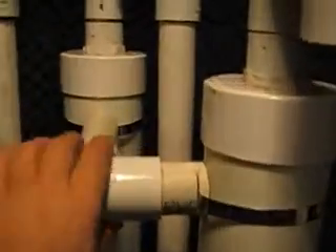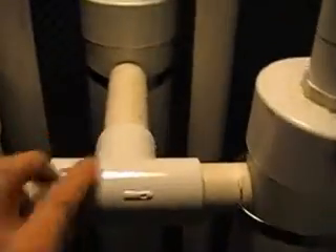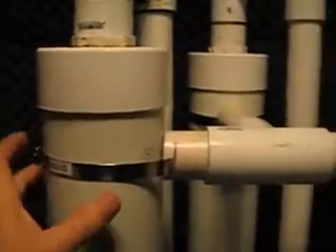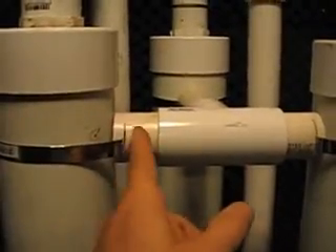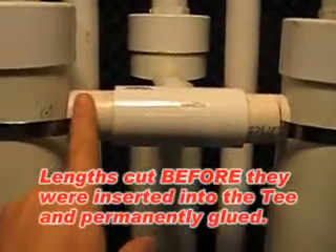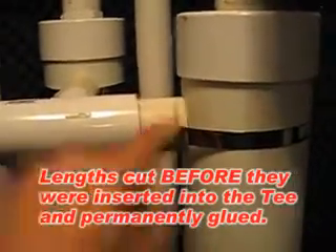What I did is I made some braces. I used one-and-a-quarter-inch T-connectors - you've got to make two of them, one here and one down at the bottom. I used four-and-a-half or five-inch pipe clamps to go around these, and I took a hacksaw and came back a quarter of an inch or so and sliced back on those so I could thread them through. I think two and three-quarters, two and three-quarters cut, and six inches cut for the pipe right here.